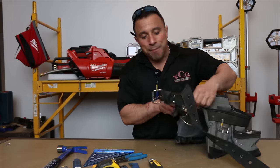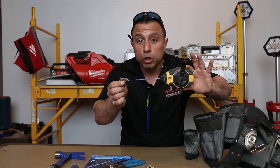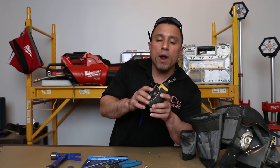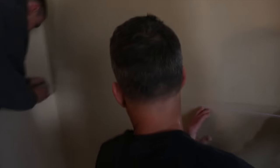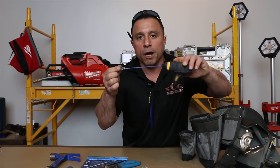Last but not least inside my tool belt — this is my personal tool belt and these are my hand tools — every apprentice should have a nice chalk box with blue chalk in it. They have chalk boxes in blue, red, or black, but always remember: the reds and blacks are indelible. Blue is actually not indelible — it will leave a mark but can be cleaned off. If you make the mistake of using red or black chalk on something like chair rail, you could find yourself needing to reprime and paint an entire room because you couldn't get the chalk marks off. Go with something cleanable, like blue.